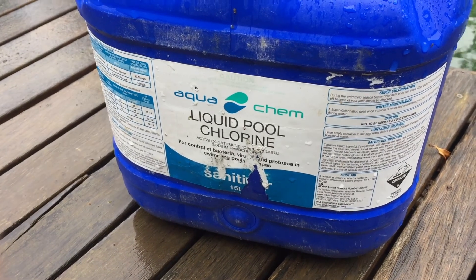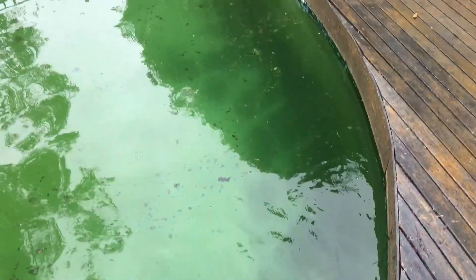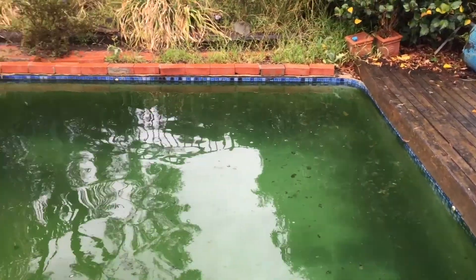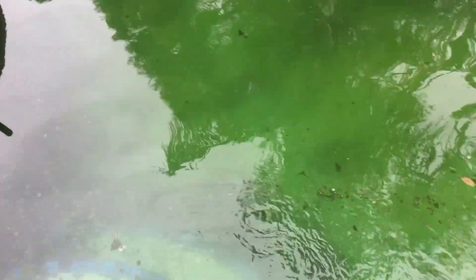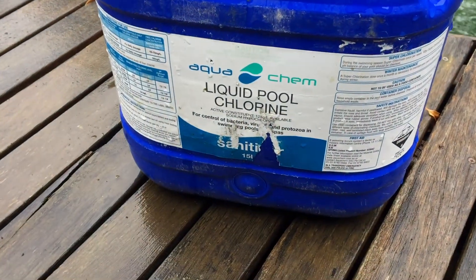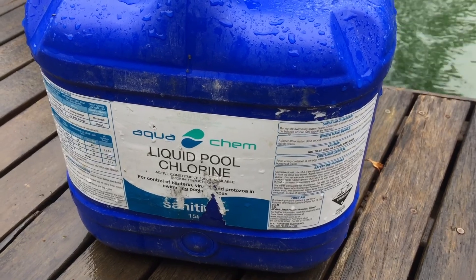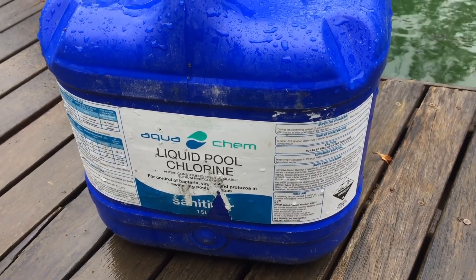It's chemical time. This pool is looking a lot better now — I've leaf raked out kilos of green slime off the bottom. It's nice when you get so much up with the leaf rake that it didn't pass through the net, so I've been able to get lots of it out and really change the color and quantity of what's down on the bottom. For liquid chlorine — you can get chlorine in all sorts of forms, but when you want a shock dose for a green pool I definitely recommend liquid chlorine every time. It doesn't leave a residue, you don't have to mix it, it goes in and works instantly, and it really is the best way to go. I'm not a big fan of calcium-based chlorine.